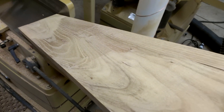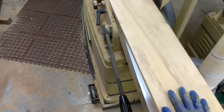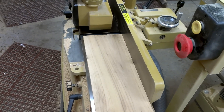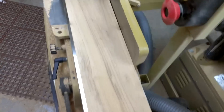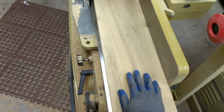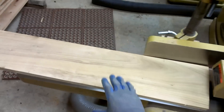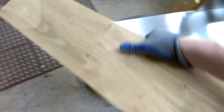Kicks it out, you can see where the high spots are right there, and see where the jointer actually hit. I'll pop it back on there again, just like that. You'll notice I keep my hands well away from the actual cutter head — power feed does the work, and one more pass, I think.